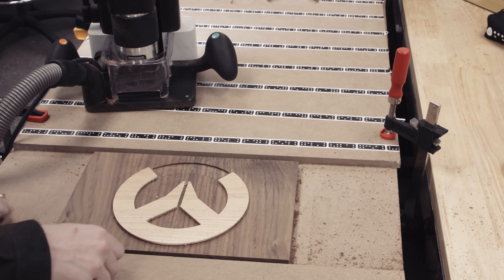The next day I pull them out of the clamps and clean them up. There are a bunch of ways to remove the excess wood. You could use hand planes, a belt or orbital sander, or a drum sander. I'm going to use a band saw first to cut off the bulk of it, then run them through the drum sander.